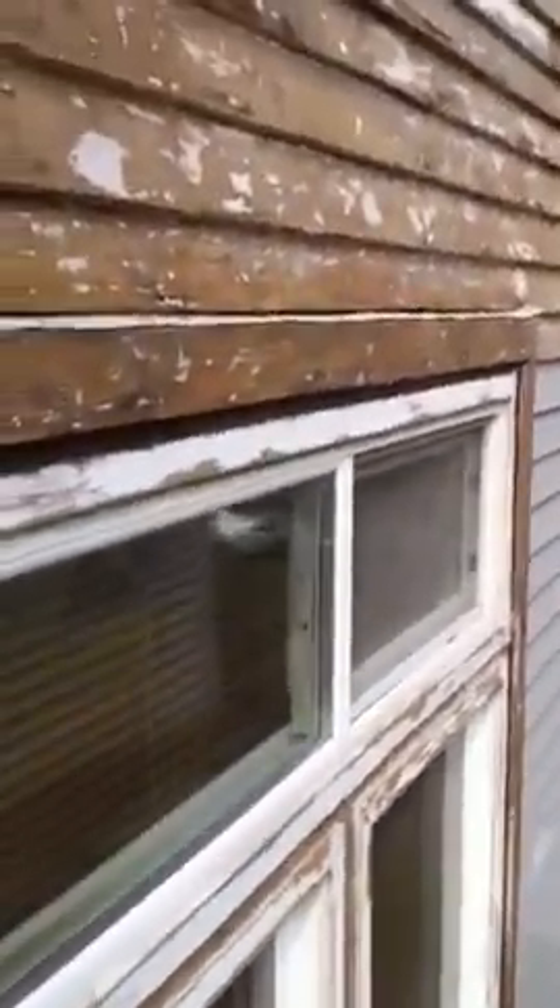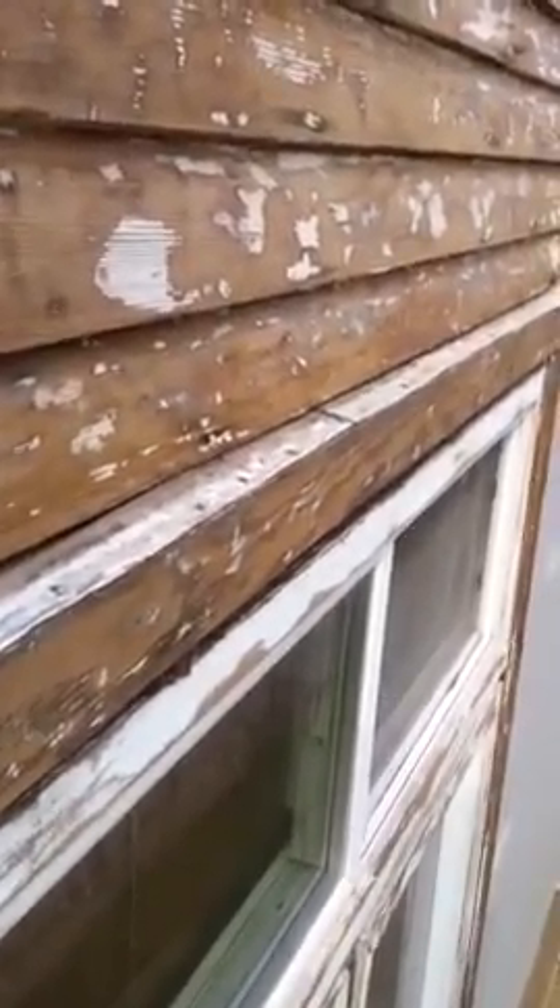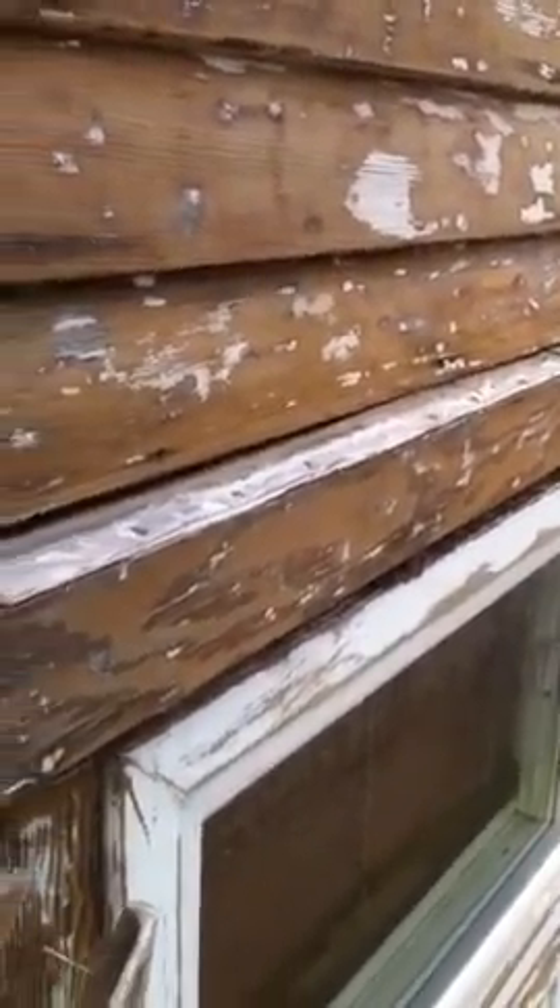I went up the ladder and started to remove this old-style flashing. I noticed that the casing was made of two pieces of wood — there was a break in the wood. It looks like there is some really bad wood rot behind there. They put this metal strapping from who knows how many years ago; it looks really old. I peeled back layer upon layer to see what we were actually dealing with.